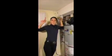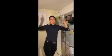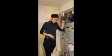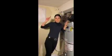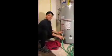Since you've let air into your pipes, you're going to have some air working its way out through your plumbing system. Go ahead and leave the faucet upstairs open until the gurgling stops. You can hear the bubbles in the system. It should take just a few seconds. And then you're pretty much done. Once that sound ends, you're going to go upstairs, close the spigot, come down here, disconnect your hose, and you're finished.